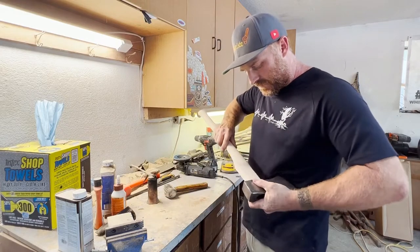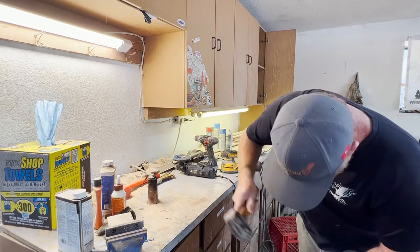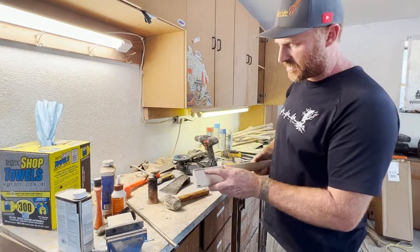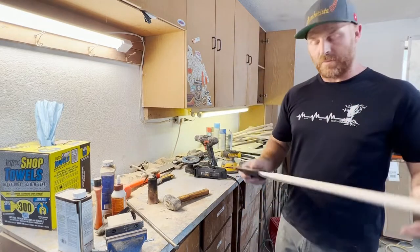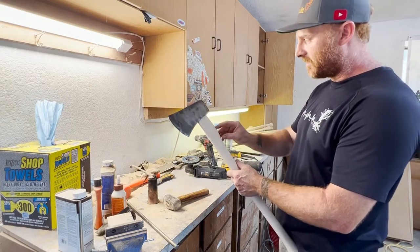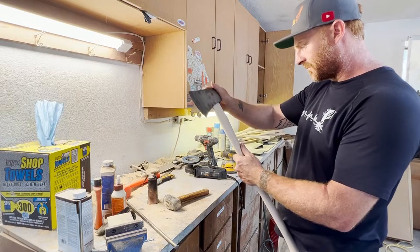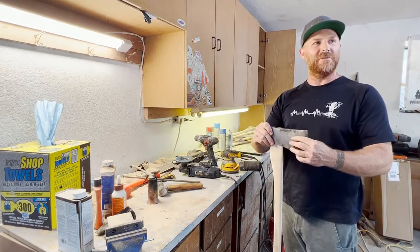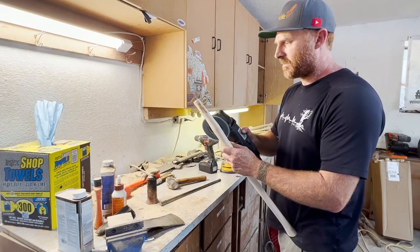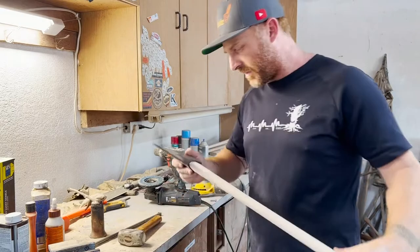It'll start leaving marks and that's where it's touching, so that's where I start grinding out. You want to seat the head all the way down, and then you cut your groove — the kerf — after that. I'll fit it all the way. This is the shoulder. I like getting pretty much half an inch above the shoulder; I like them to sit right down on it. Got a lot of meat down there. Okay, so we're all the way down to the shoulder.